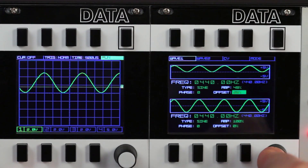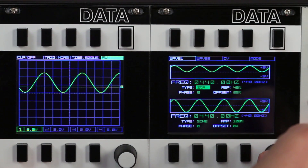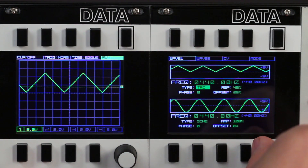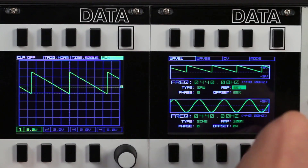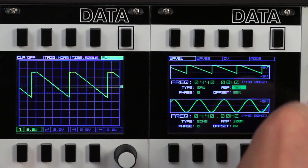This is very handy for using the waveform as a CV source, such as an LFO. Here are the familiar waveforms: sine, square, saw, and triangle. The amplitude control can add gain as well as attenuate. The gain can clip the waveform, changing its shape — in this case, the saw is now a trapezoid.